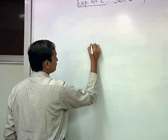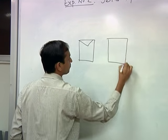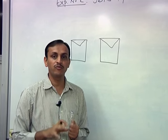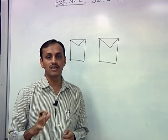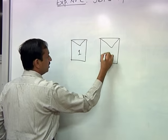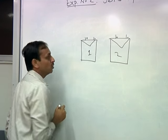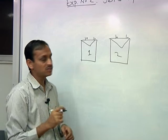For example, if I have PV Module 1 and PV Module 2 — assuming all modules are identical — in your laboratory kit four modules are provided with almost identical characteristics. When you connect them in series, the plus terminal of one module connects to the minus terminal of the other module, giving you one terminal at each end.